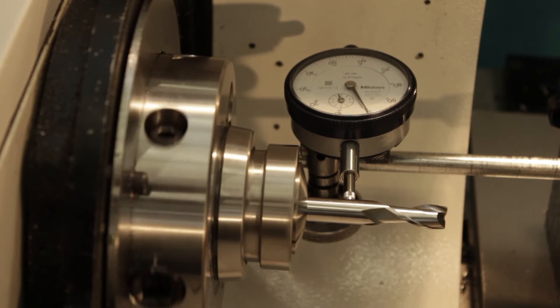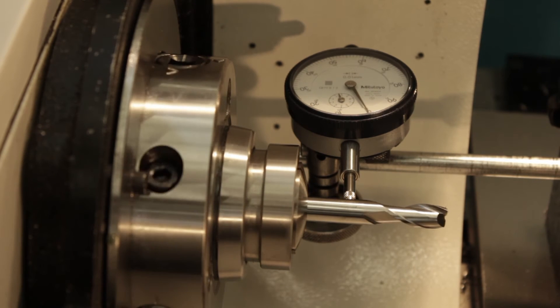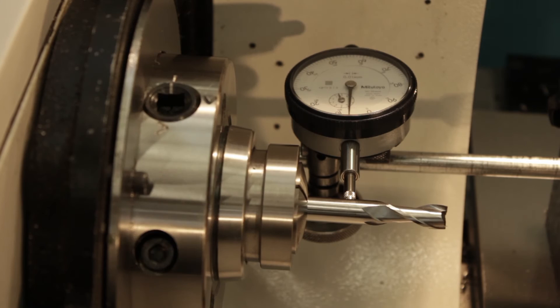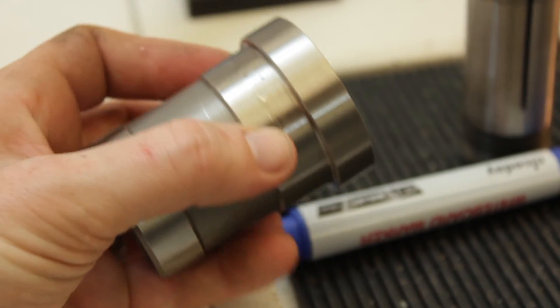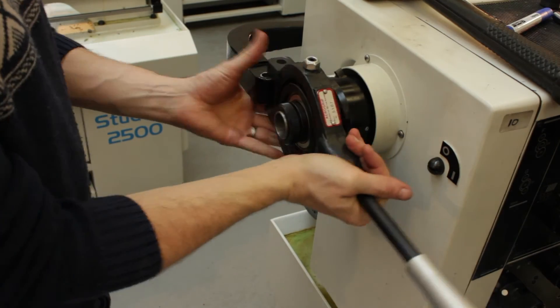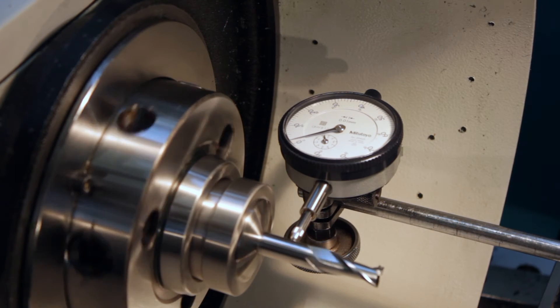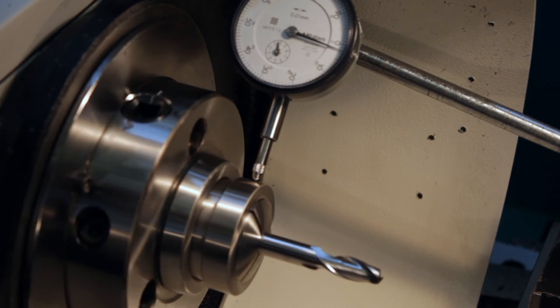You're now seeing a different milling cutter set up in the collet chuck because I had to verify something. I was under the impression that collet chucks were accurate within about 0.01mm; however, trying several collets and milling cutters I'm getting runout of about 0.06mm. Taking the collet system apart, we can see a tiny piece of swarf — and that's the source of the runout. We cleaned it, put it back together, gave it a tap with the mallet, and although the initial setup takes a few seconds, subsequent changeovers can be done within one second. Cleaning the adapter halved the error to about 0.03mm.